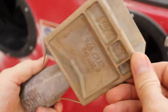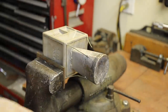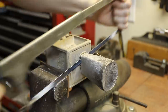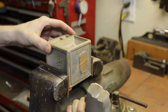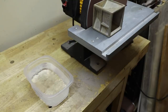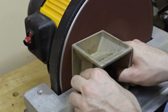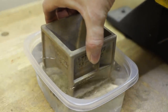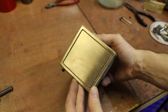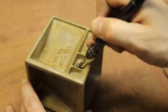After removing the shell, I was happy to see that the mold filled out properly and the casting looked good. Next, I snipped off the vents and used a hacksaw to remove the sprue. Then using my large disk sander, I carefully sanded the bottom smooth. I actually had a hard time polishing this measuring cube, as the little pockets made it very difficult to use anything other than wire brushes, and even then I still had a hard time reaching certain areas.